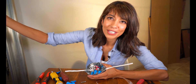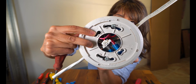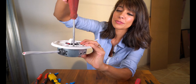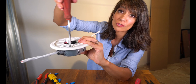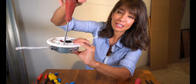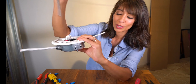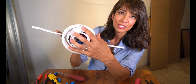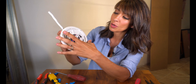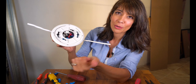When it comes to installing your mounting plate, you're just going to back out the two screws here. Once it's in your ceiling, you're going to twist it ever so slightly — that is going to lock it in place. Because it's plastic, you don't want to tighten it too much; you'll over-tighten it and actually break your mounting plate. I've seen that happen — in the last house I did, there were two that came apart because they weren't screwed in sufficiently. So you want to make sure they're snug, but don't over-tighten it because plastic will break.